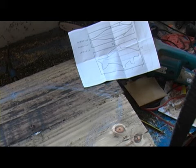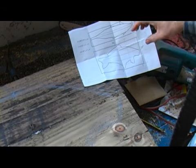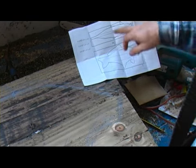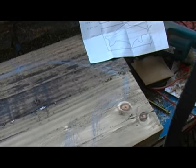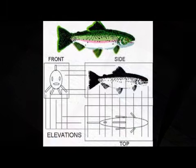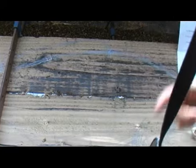We have to look at the actual drawing and carving from the profile and from the top. I've drawn out these shapes copied directly from the photographs onto the computer, worked out my sizes for the timber, and then drawn it onto the actual block of wood from the side. I'm going to cut that shape out first with a chainsaw, then go from the top and cut the shape down the other way, so we've got the basic profile of the fish both ways, and then we just have to round it off.